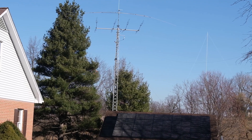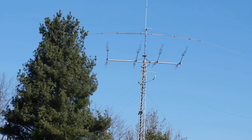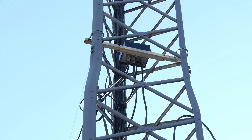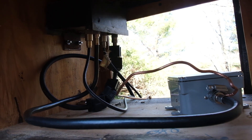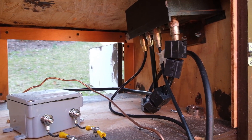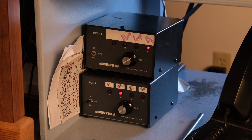I wondered if I could create a higher-performing antenna for a DX contest in a field-day style using temporary antennas. I already have two antenna coax feeds from my shack out to remote antenna switches. One switch on the tower feeds the 80-meter dipole, the 40-meter dipole, and the tri-bander, leaving one open connector for an extra antenna. With the other coax — which ordinarily feeds a loop — I installed another switch for my listening antennas, and I wondered if I could add a couple of beverages to help with receiving.